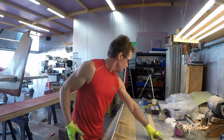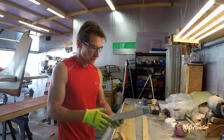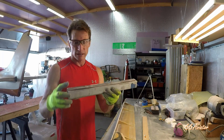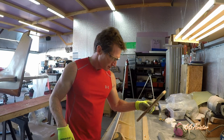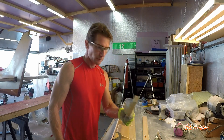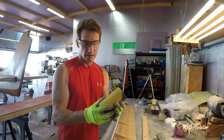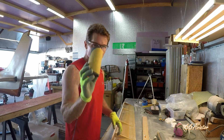Back in the shop with the Lancer. I have a lot of homemade tools like this longboard. Here are some sanding tools I've made up: a piece of one-and-a-half inch aluminum tubing with a long strip — tape an emery strip over it and you get a perfect straight edge. Another is just a board with 80-grit stapled on for breaking stuff down fast. For curves, a piece of plastic tubing with a sanding strip taped on works great — even a paint stick works. And a really good one: soft foam pipe insulation with a sticky-DA pad. Squeeze it into a corner and it works perfectly for getting shapes on the airframe, like transitions between the wing and fuselage.